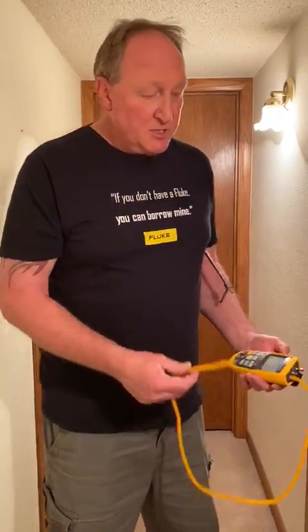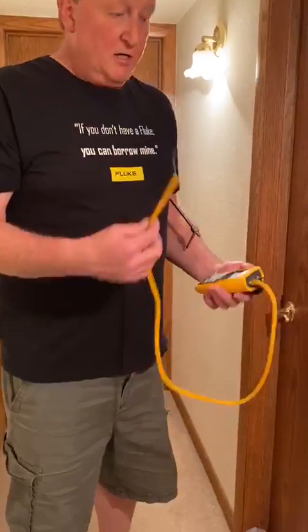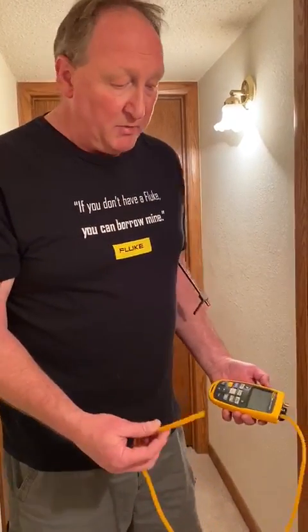In this environment, it's very difficult to try to do some of this stuff outside of our homes due to the isolation we have right now. So I tried to create something very simple that would show a positive pressure and a negative pressure. Behind this door is my bathroom. Basically in most homes there's a register or supply vent that would supply hot or cold air, depending on the season, to that room. And in most cases, because there's not a return air in there like you would see in normal applications, it would want to go under the door. So I blocked that off — we're going to show a positive pressure on that.